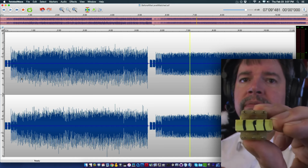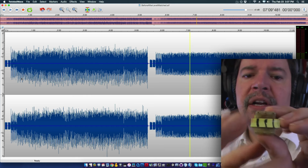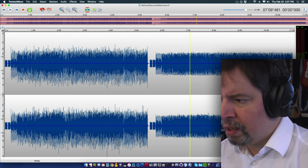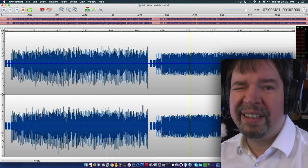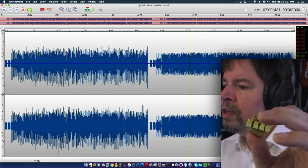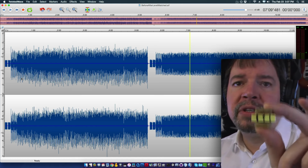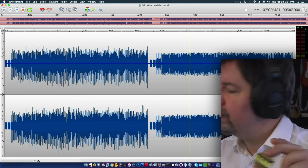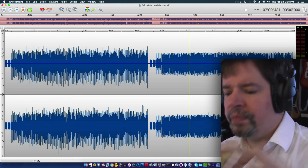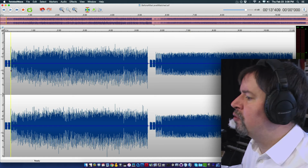This is a cable. It's an elaborate cable. You're going in here, and we're going out here. If you unwound all the windings, you'd have probably, I don't know, 60, 100, a couple of 100 feet of very thin wire. And it would start in one place and go 100 feet away to another place and stop. So this is a long, long cable that's wound up onto a magnetic core. And for that reason, there's nothing to particularly fail us when we're trying to get actual bass through, like here.